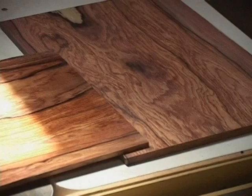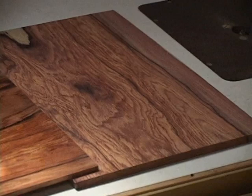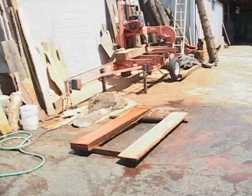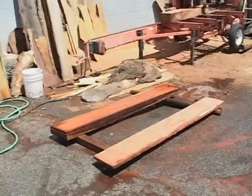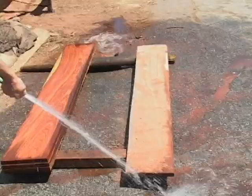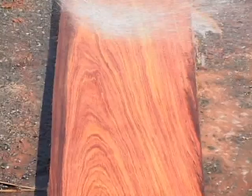Here's another piece — I have not worked this piece; it's fresh out of the planer. So you see, after you work it, the color just comes out even more intense. It has very beautiful distinct black lines. Each of these pieces was milled down to a quarter of an inch. We've been milling up four-quarter slabs, straightened up the top and the bottom. We've been stacking them in the order they've come off the logs, and washing them. The color we're finding when we wash these is absolutely incredible — it washes off all the old sawdust and you get a nice clean surface.